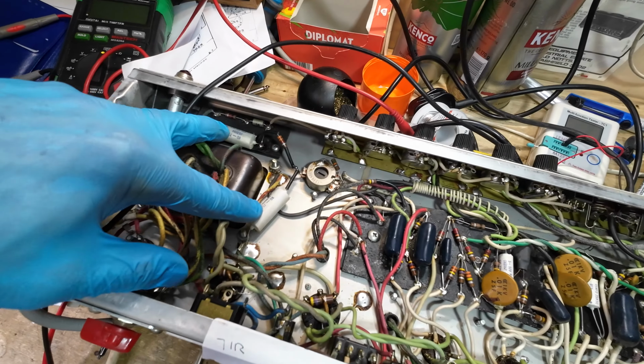We've got 56 volts and climbing. Remember, we're going to bring these capacitors up steady, so we don't want to just shock them with full voltage. We're up to 75 volts now. We've got the meter there, look, you can see the rectifier tubes just beginning to conduct. You can see the plate voltages going up there. The bulb is dimming slightly, but we're going to let that climb.